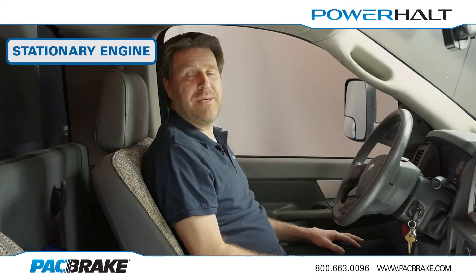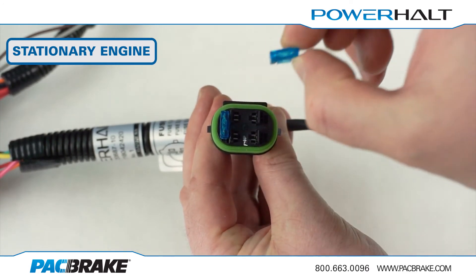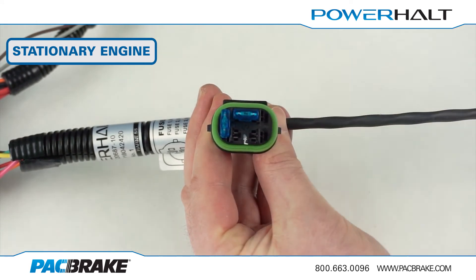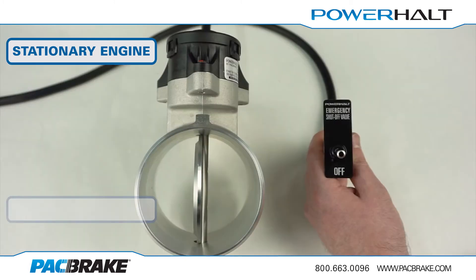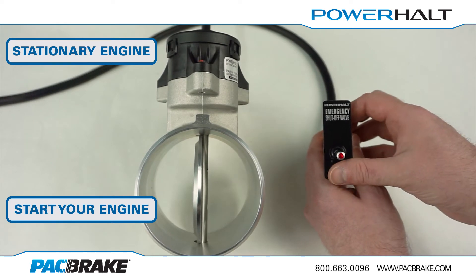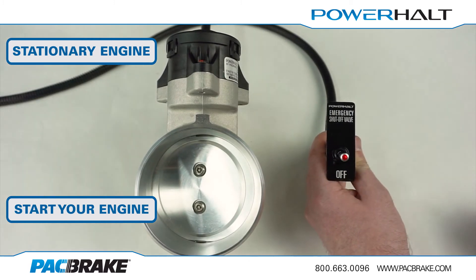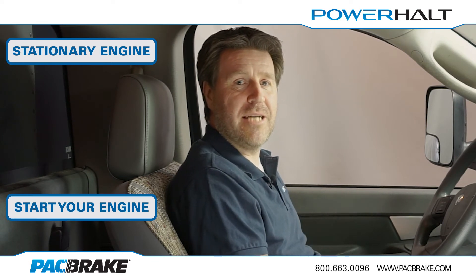Next, we will look at programming your PH3 for stationary engines that operate at a constant speed. Step 1 is to insert a fuse into F1 on the mode selection box. The indicator light will now exhibit a constant rapid flash interrupted by a single pulse when setting for a single trip speed, or a double pulse if a secondary trip speed is active. Start your engine and allow it to run at constant operating speed. Now push, pause, and then release the switch to shut down the engine and save your input speed. The indicator light will become solidly lit. When the light extinguishes, choose your desired overspeed margin to set your trip speed.